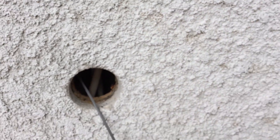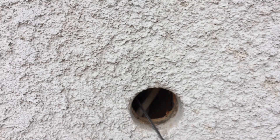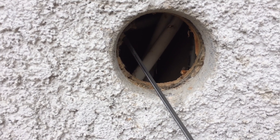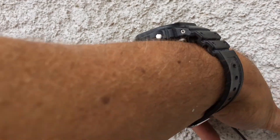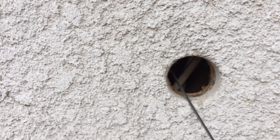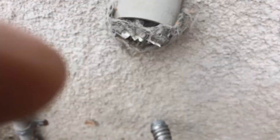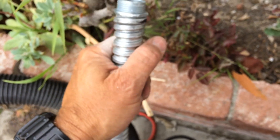I put a piece of tape around my fish tape so it didn't catch the wires — as you can see, there were wires in there. I killed those circuits that were in the wall; the ones in the garage are on a different route. These things are really tight and stretched out, so I'm not sure how successful I'll be pulling up the flex. It looks like it's still going to be hard — I'll have to pre-bend it to where it takes a curve on the way up.